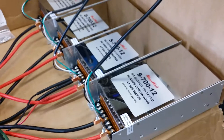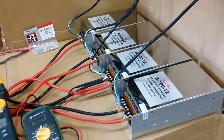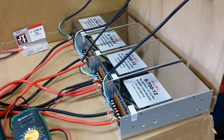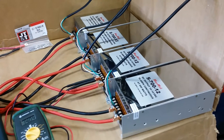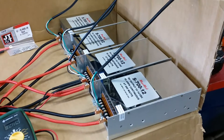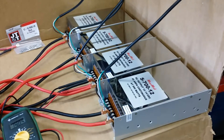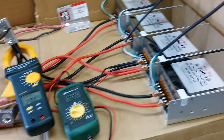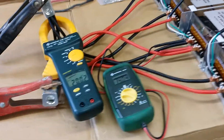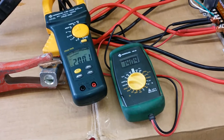These run super clean even under a parallel hookup like this. You would have to run dual circuits — as far as the AC input, you're going to need a couple of 120 volt circuits coming in because you're talking about 28 to 30 amps that it's going to be pulling off the system. As you can see, it just holds pretty steady around 200 amps.